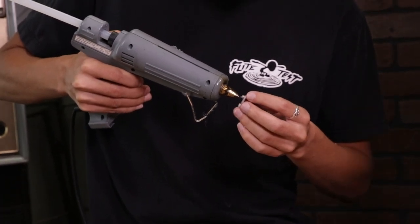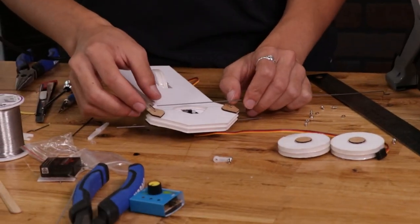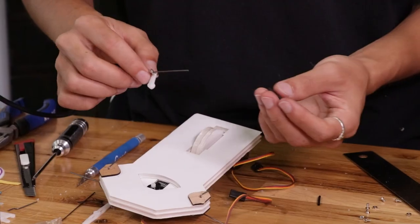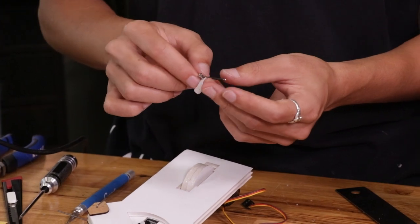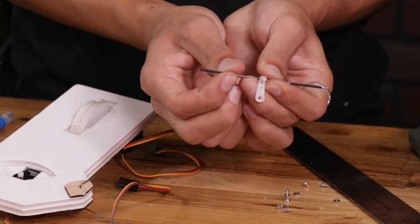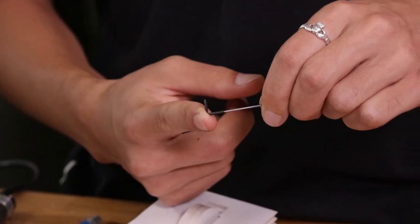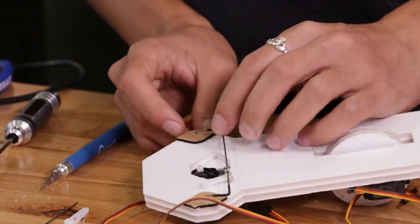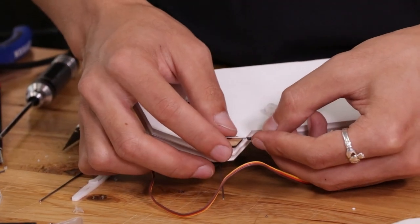the servo arm. Next, cut a piece of pushrod wire that fits right in between the 2 pushrod pieces sticking out of the top of the frame. Next, we'll slide this pushrod through our linkage stopper and use a bit of heat shrink to secure it to the pushrod sticking out of the top. This creates a hinge between the pushrod we just cut out and the 2 pushrods we installed earlier on the sides of the frame, which allows the steering system to actually rotate.